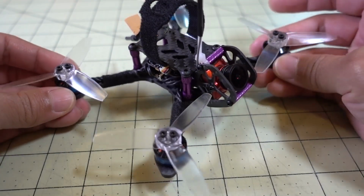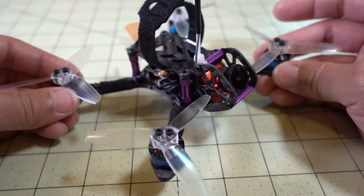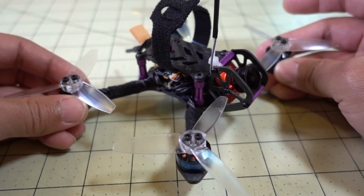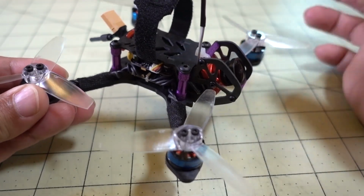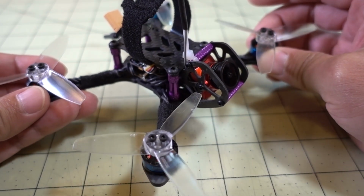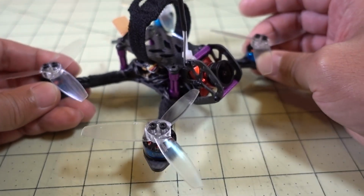Yeah, so anyway, if you want to duplicate the setup, you obviously could buy the Turtle and then swap out the motors and camera. But of course, then what are you going to do with the old motors and camera, right? So you could just buy the frame. The frame is $14, and then you can just buy the motors, the camera, and then a stack. And pretty much any 20 by 20 stack will work, as long as it's around 20 amps. I believe it's a 20 amp stack in there. That's pretty much all you need. So I'll put some parts in the description. You guys can mix and match as you please.